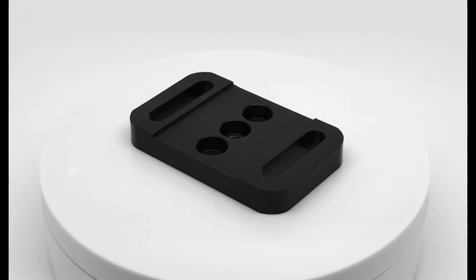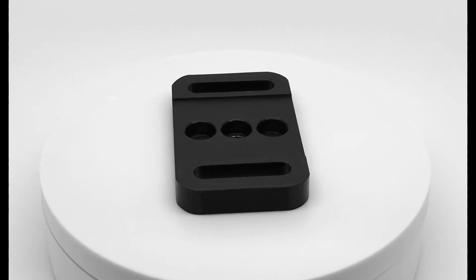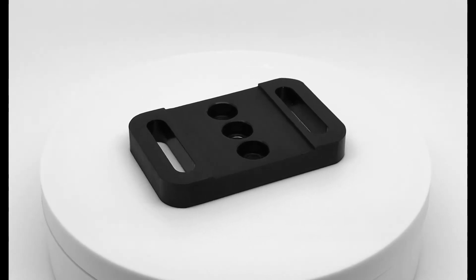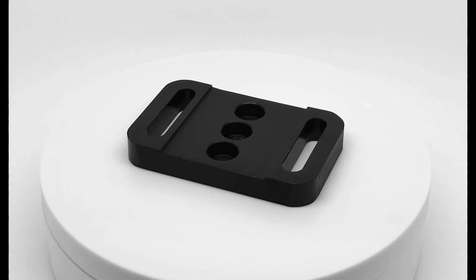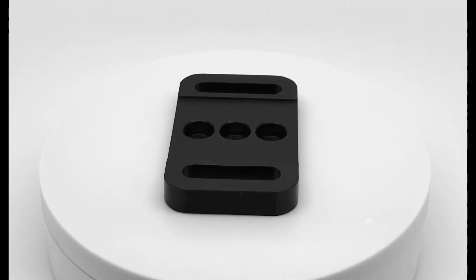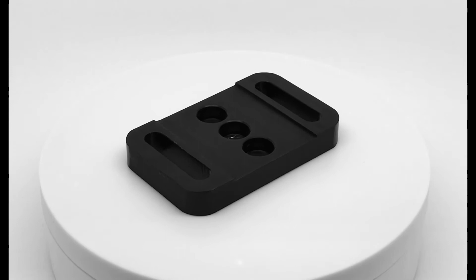Next up is the BAS002 or BAS002-M mounting base. This baseplate has dimensions of 1.75 by 2.75 inches or 44 by 69 millimeters. As our most popular mounting baseplate we offer, this has 3 counterbore clearance holes for 1/4-20 cap screws to be inserted. Additionally, 2 clearance slots are also provided to allow easy mounting to the surface. This baseplate is compatible with imperial tables, posts, and post holders.